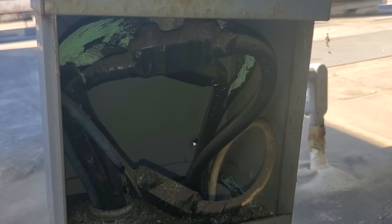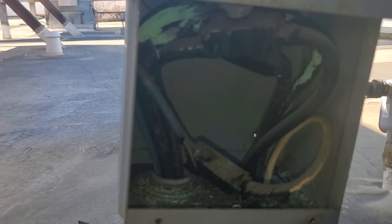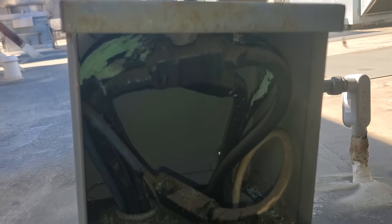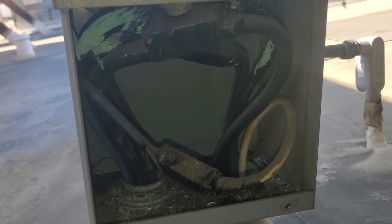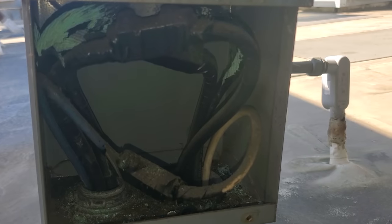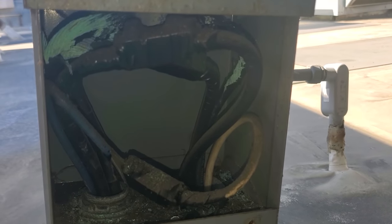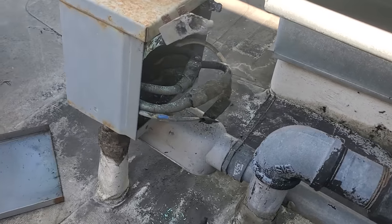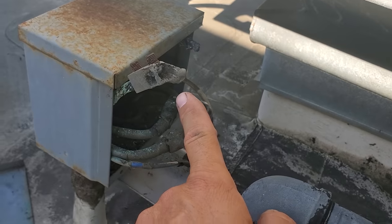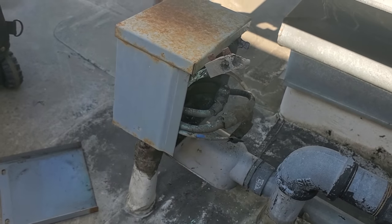Look at that. Whoa boy. That wire is fried. Mega dangerous. Lucky it didn't trip the breaker. I don't know if we can repair that or not because there might not be enough wire here. Holy Majole. That's not good. Look at that splicing lug — it had been arcing and it completely melted the lug.